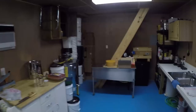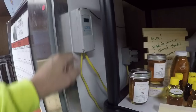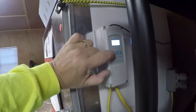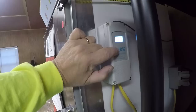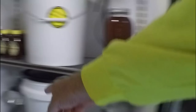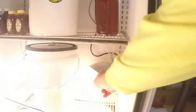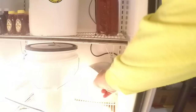Then I wanted something bigger, so I moved to a commercial freezer that a guy was throwing away. You can use a regular refrigerator the same way. This commercial freezer I got from my buddy Kenny — you can buy simpler ones now with receptacles that plug into the wall. Right now it's set to 96 degrees Fahrenheit inside; it tops out at 100 and cuts back off, and my differential is 5 degrees so it turns back on at 95. I have it wired to turn on a heat lamp and a regular lamp inside, and you have to watch the wattage to avoid a fire hazard.